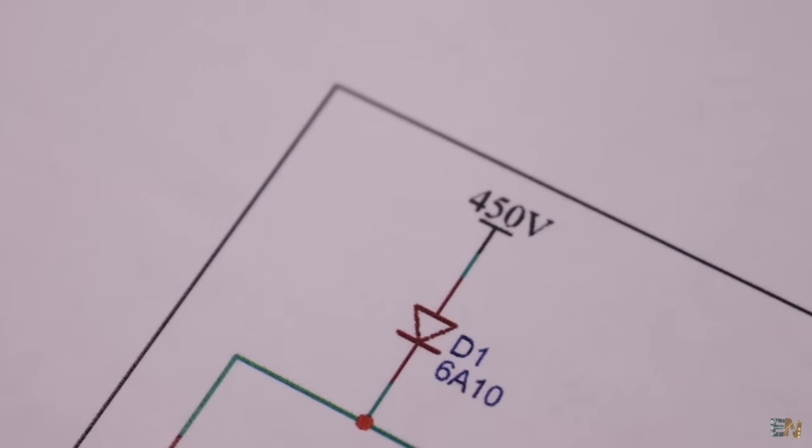And as you can see, the PCBs have exposed copper, so we can merge them together with solder. So we put them like this and we solder the connection. We have three connections on the top side and one more on the back. So I place the PCB flat on the table and join this part together with the next segment using some solder and some solid wire. Now the first segment is in place. I add two more segments for now and we'll see later if we can add more.